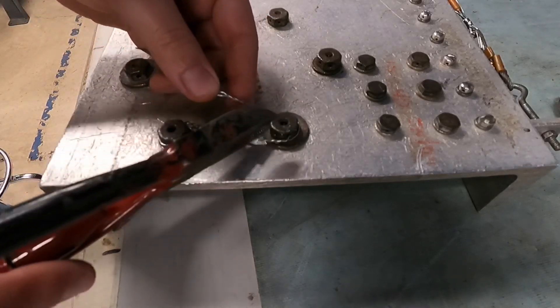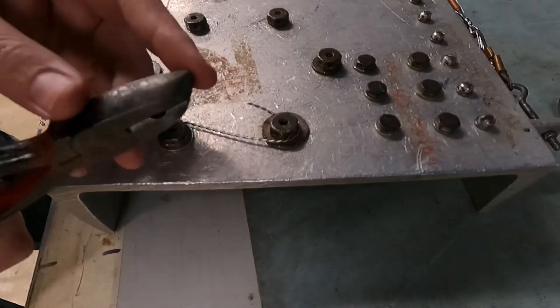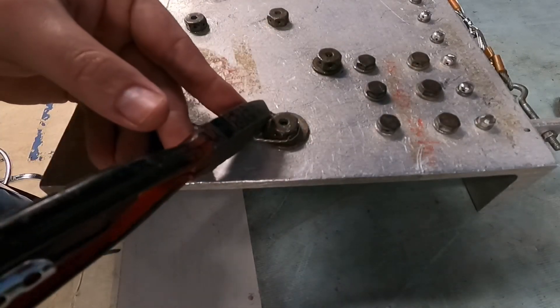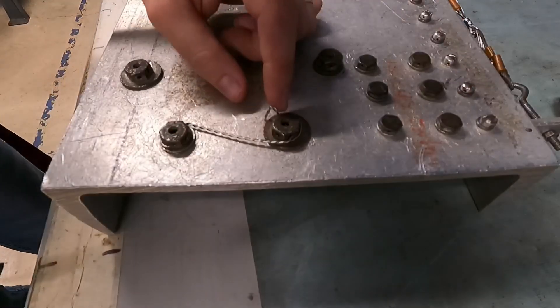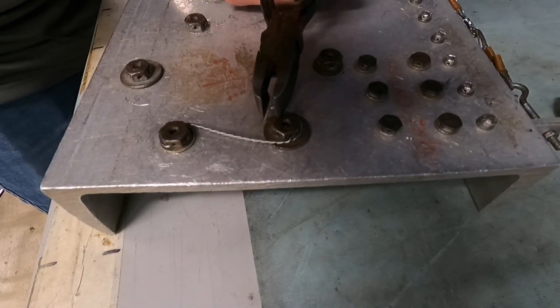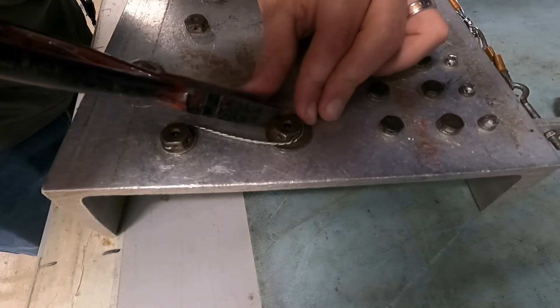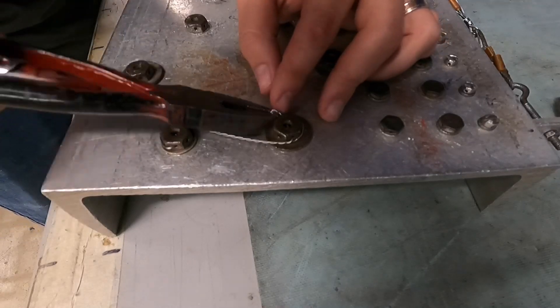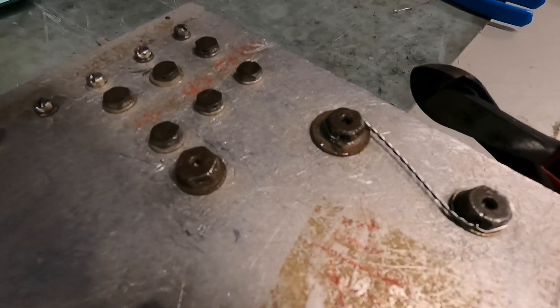This leads me to tip four. Now that I've got this all wrapped up, I'm going to bite it a little bit higher than you would expect with the safety wire pliers. Then, using the pointed tip of the pliers, I'm going to grab the pigtail, pick it up, and twist it down about halfway up — making a cone shape. Then I'll grab it right in the heel and clamp it down so that the pigtail is now wrapped back up underneath itself. Once that's done, you can't cut your finger on it because the pigtail is sitting up underneath the head of the bolt.